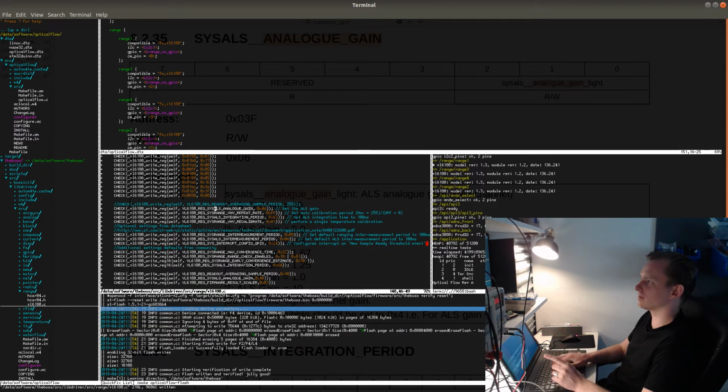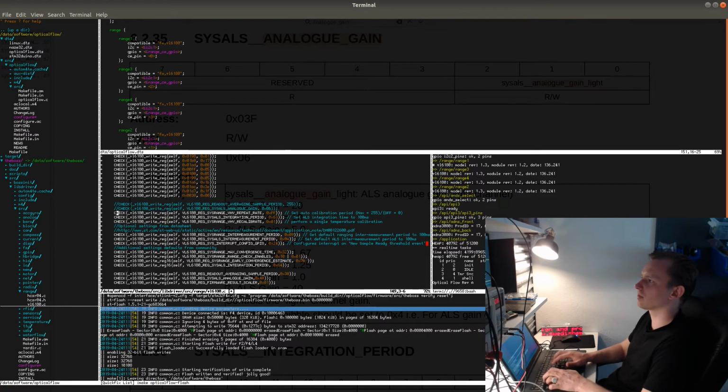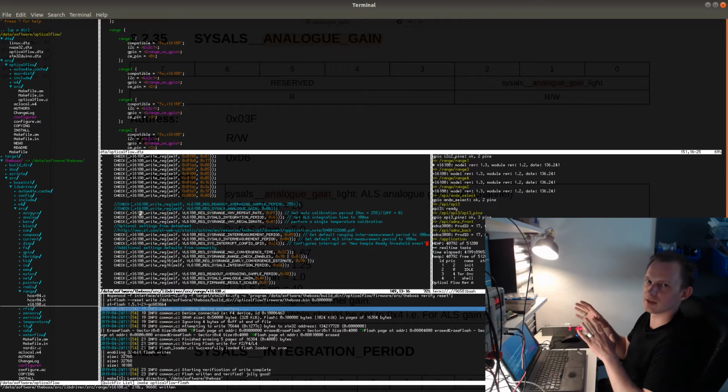This is why I don't like using the Arduino libraries as is, because they are not always correct, and they're not written with real-time RTOS in mind. So any kind of delays in the libraries, I would replace them with the proper delays. And where possible, like if there is a delay that is, let's say, 800 microseconds, and it doesn't have to be exactly 800 microseconds, then it's better to make it a millisecond delay, because then the task can actually sleep and everything else can run while the task is waiting, instead of the task wasting CPU cycles.